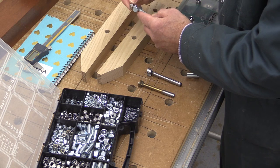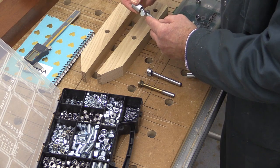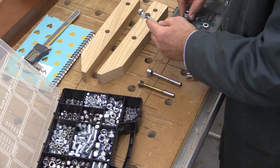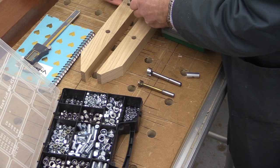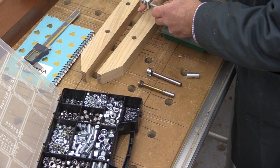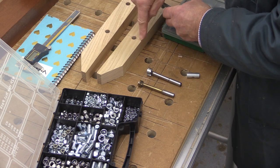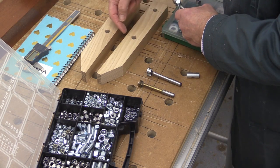The diameter across the wider section here is 15mm. But I'm going to need to put a spanner on the outside one, and that spanner has a diameter of 18mm. So the hole coming in from the outside would be 18mm, and the hole coming in from the other side would be 15mm. The same would be true for the other position.